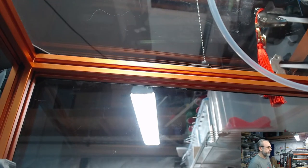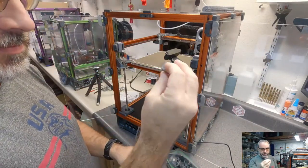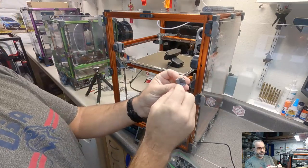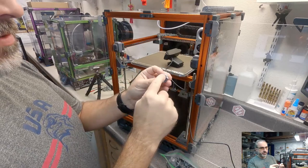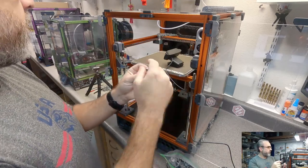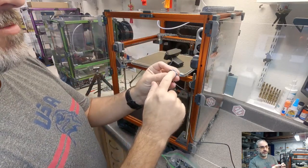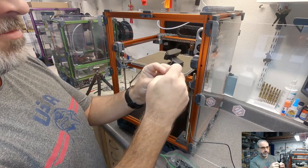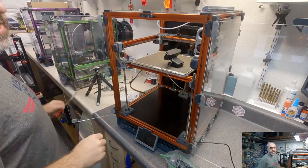Hey, you can see. So these guys... I want the other version, and I'm going to take another detour here. So these are all individual segments printed. There are 20 of them. So your top surface quality is going to be important for these, for the LEDs to line up. A 0.1 millimeter difference of over extrusion or whatever is going to multiply by 20 across that.